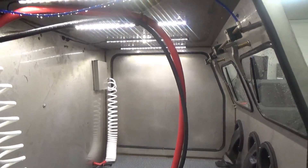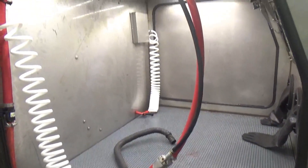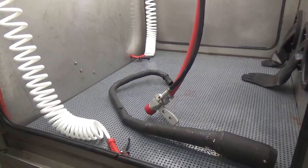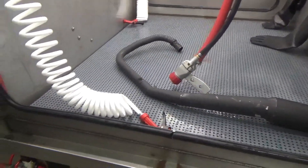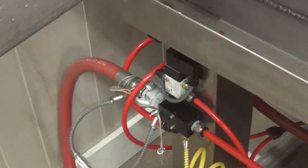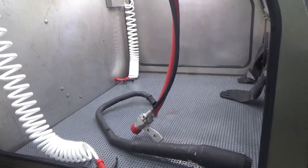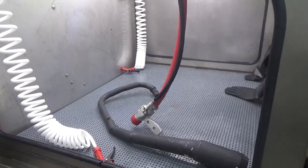This is a behemoth — four LED light bars, this thing lights up like a Christmas tree. We have high production blast guns, blast hoses, and a one-inch slurry line on this machine. You need about 40 CFM to run a machine like this. On the back we have a three-quarter inch crow foot connector to get the proper CFM. Let's fire this bad boy up and see how quickly we can remove this paint off the exhaust system — stay tuned.